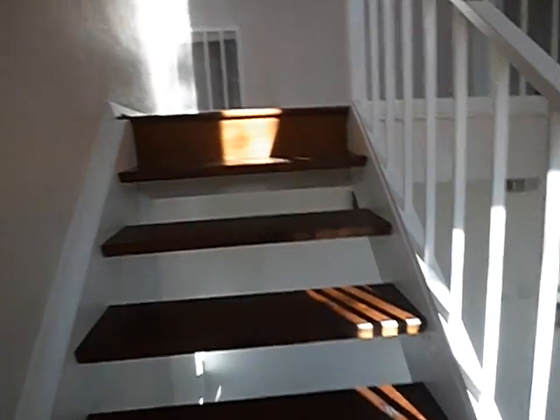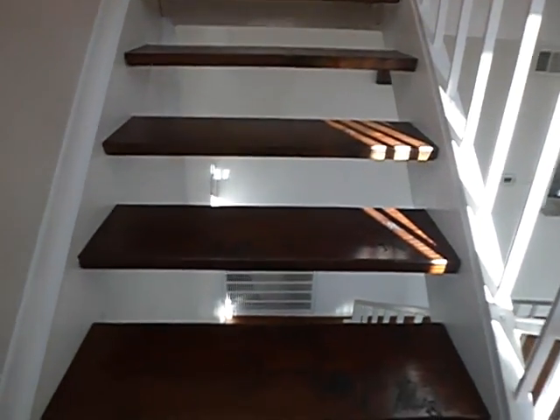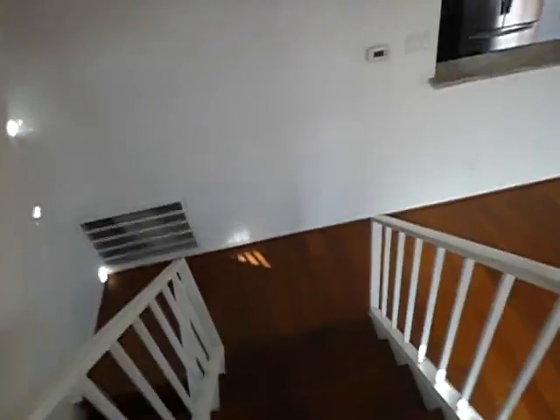Another 33 inches here. Seven-inch space underneath the stairs? Open risers. Are these handrails graspable? No, they're not graspable. So the handrails are not graspable.